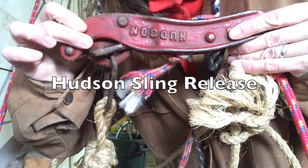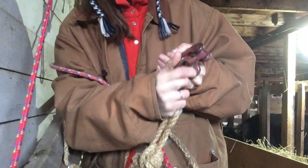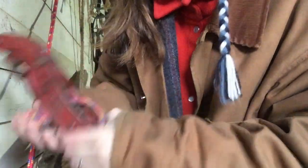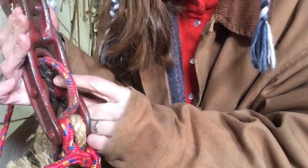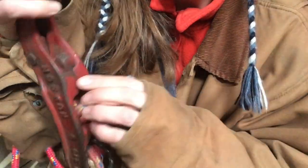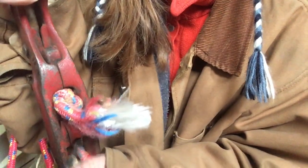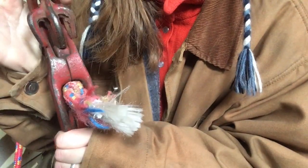Here are some extra details about the sling releases we use. This is our Hudson sling release. We have a metal ring here that we hook in — it holds this ring in place. The release rope is tied with a knot to pull through here. The rope runs up over the center pulley and down here. This is what the rope pulls on, so when you pull the rope, it pulls that down which releases the tooth. The ring fits in here, then it snaps shut, held in place until the rope is pulled and it releases.